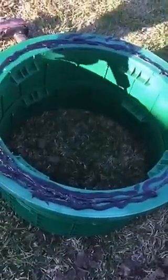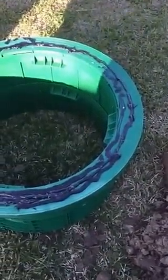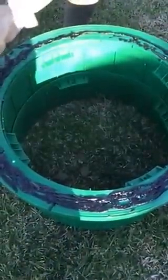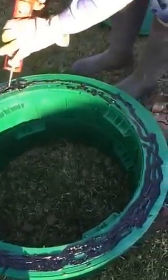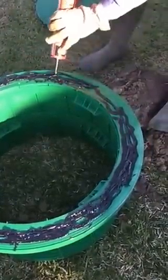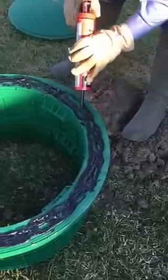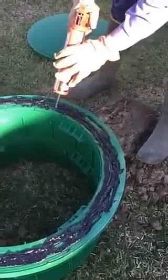He's going to squirt that all over the place. I see a lot of guys who will pre-drill holes in the tank with blue screws, use a mastic, and do all that — but we've never found that to be necessary. We've never had an issue. We've done literally thousands of these things, and this is how we've always done them. Once that thing's on there, I guarantee you won't be able to get it up — you'd need to take a shovel and pry it open. It seals real good. We don't have any problems with water infiltration or sprinklers going off non-stop in the aerobic system.